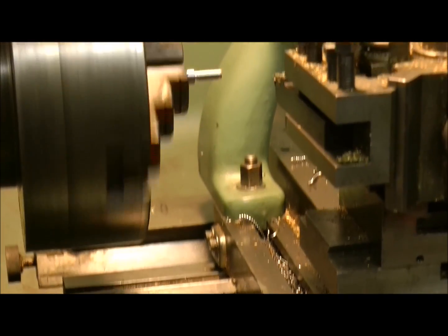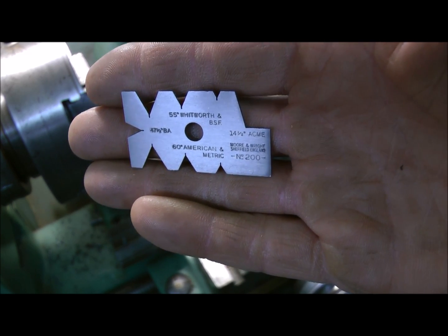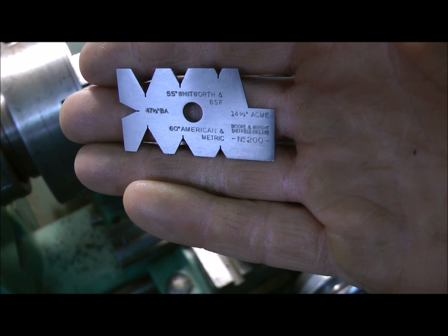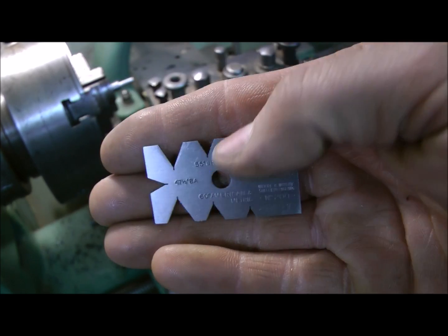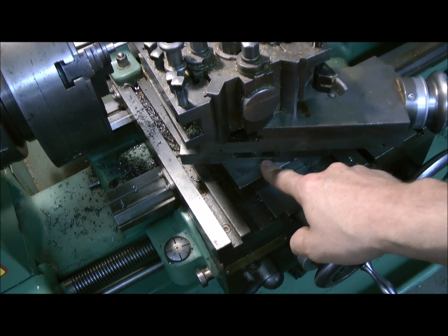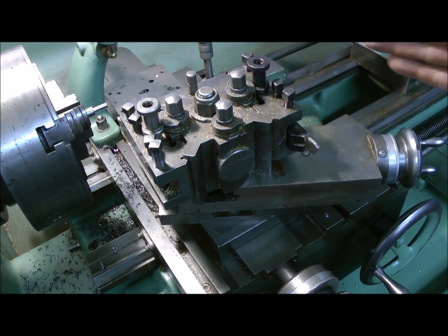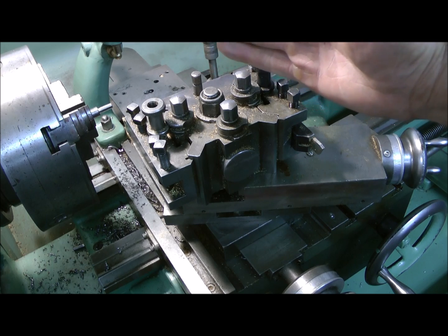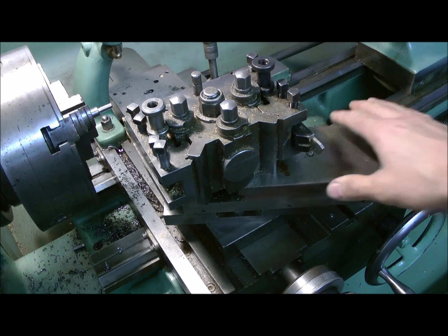It's just a matter of setting up the compound slide. This is a handy tool for setting up the correct orientation of your screw cutting tip, and we'll be using Whitworth — 55 degree. Off camera, I've set up the compound slide at 29.5 degrees. The idea is that when you're advancing the cut, you're only cutting the front of the thread, which makes it a lot easier to cut so you get a nicer looking thread, and it's not as harsh on the cutting tool.